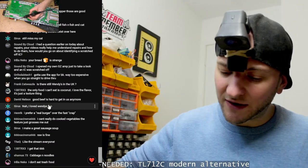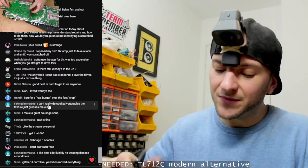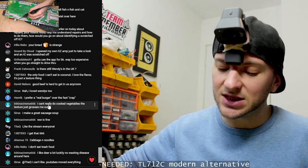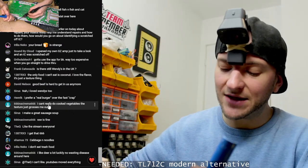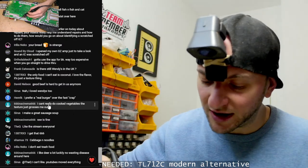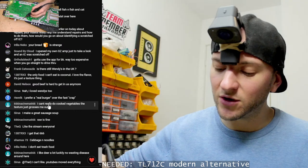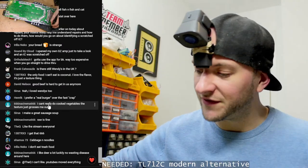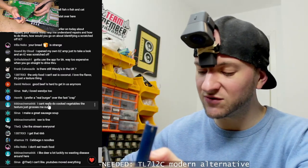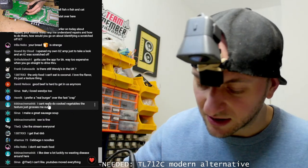And then you have to look at what circuit it's in. So for example, Class D MOSFET driver, there's only really a small handful of commonly used Class D output drive ICs in a given package. So then you look at the pinout, and you look at what's connecting to what, and then you look up a few data sheets online, then you might find one that has a matching pinout, and then you're like, oh, it's probably going to be one of those. And if there's a few variants of that same sort of pinout chip, then you look at what voltages are going on the board, what the rail voltages are, what the switching voltage is going to be, and then you can identify what part it's most likely to be based on all those factors.